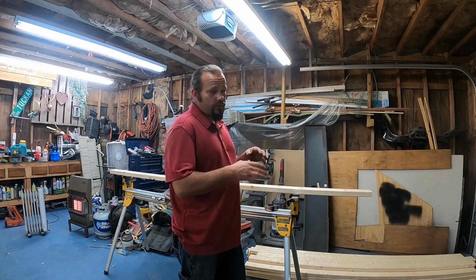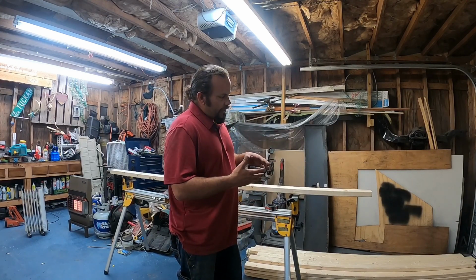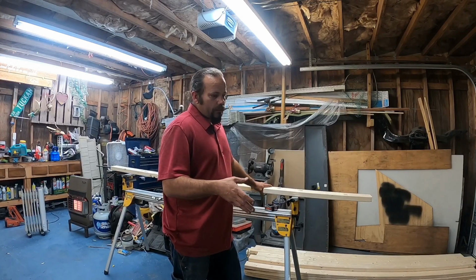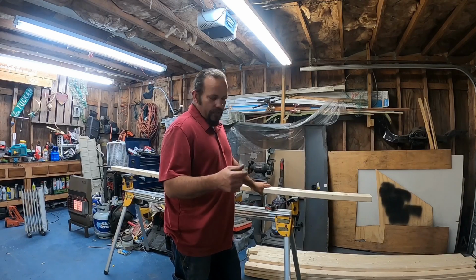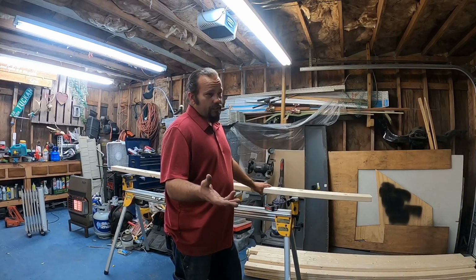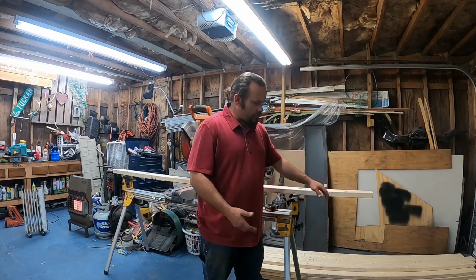And I'm going to be cutting the 2 by 4 not at 2 foot, because that'll make my shelves wider than 2 foot. So you get to take off 3 inches, because your 2 by 4s aren't actually 2 inches, but 1.5 inches. So you have to multiply that by 2, which is 3 inches. So then you're going to take off 3 inches from the 2 foot. So 24 inches in 2 foot. So it's going to be 21 inch 2 by 4s nailed between the ends of the 2 by 4s.